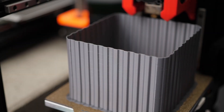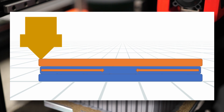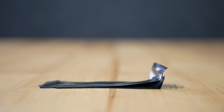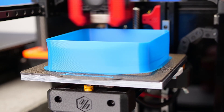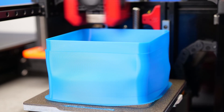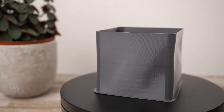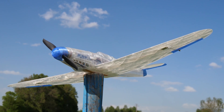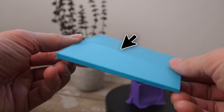Why is that happening? Well, in 3D printing we usually print in layers. Each new layer is put hot on the already existing one. While it cools down, it shrinks and therefore basically pulls on the already existing one. I demonstrated that here with pieces of tape that I pre-stretch and then put on top of each other. At some point, the internal stresses are high enough that the simulated part releases from the base and curls up. Our 3D prints have significant internal stresses that can make the part release from the base or cause the design to buckle in on itself. This is what happens with thin-walled parts — each subsequent layer pulls more and more on the previous one until it buckles in one direction or the other. This is also the reason why 3D printed airplanes are still mainly made from PLA; even the warping tendency of PETG can make those surfaces buckle in on themselves.